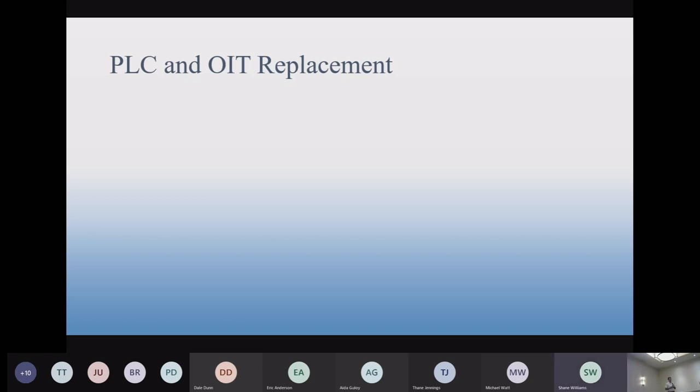I have to say, you still do have to be careful at the bottom end, because the thermocouple only goes a certain distance up. That's true, but that's only if you really overestimate the length. We have had trouble where we totally cut the thermocouple out of the sample line. That's never good. Yeah, that's happened. We put the thermocouple 50% up the line, and you think it should be impossible, and they still cut it off.